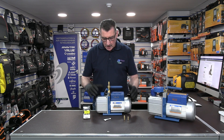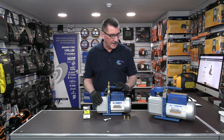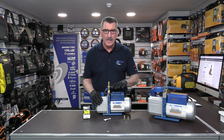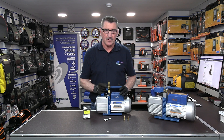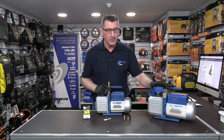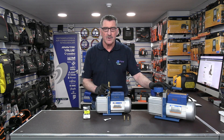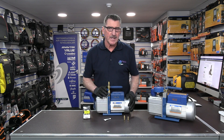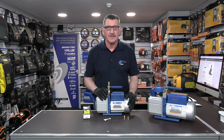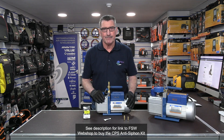The benefit is quite clear: you don't need to be buying or investing in a new vacuum pump if you've already got one. You simply buy an anti-siphon valve or a non-return valve — you don't necessarily have to upgrade to a new fancy vacuum pump with a built-in solenoid valve. Personally I think every engineer should have one on their standard vac pump. It saves any hassle potentially with sucking up the vacuum pump oil. Thanks for watching, see you again soon.